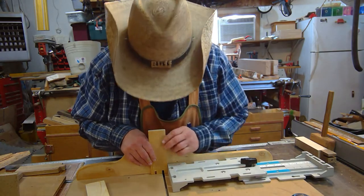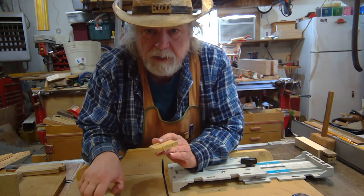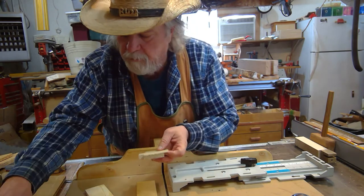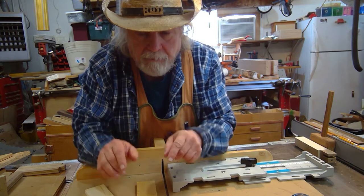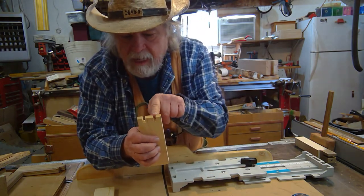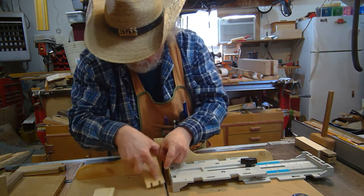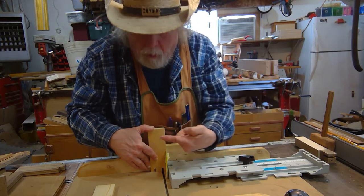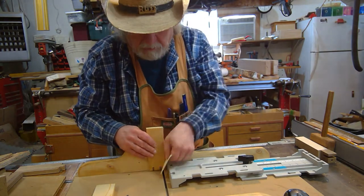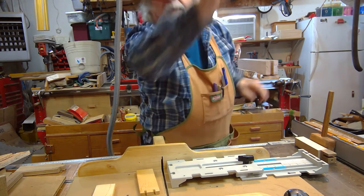I'm going to stop right here for a moment because we've defined the two outside fingers, and now we just want to hog out the center — but we have to decide: is this going to be a 90-degree joint that we're going to glue together, or is this going to be a hinge where we want it to fit loose? If we want it to be a joint, we leave it like this and just start hogging out. If we want to make it a little loose, now's the time — we take off a little bit on the inside edge of both fingers by using a one-sixty-fourth of an inch spacer, which holds the board one-sixty-fourth of an inch to the left, taking off a very tiny amount and making that finger slightly smaller. But since we're going to do a joint instead, I'm not going to do that step because you only do that for hinges.